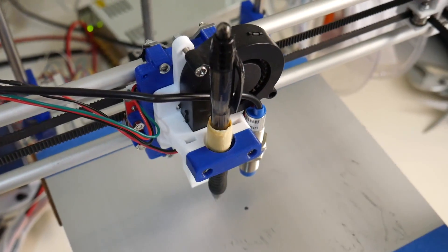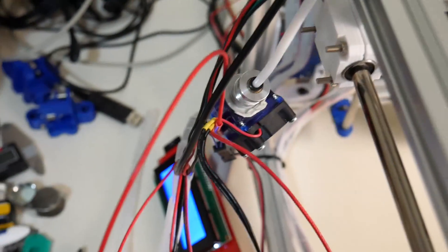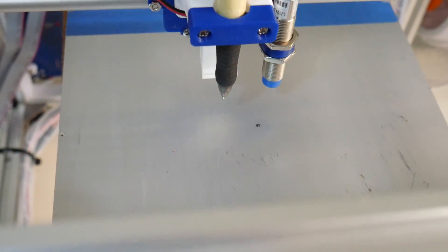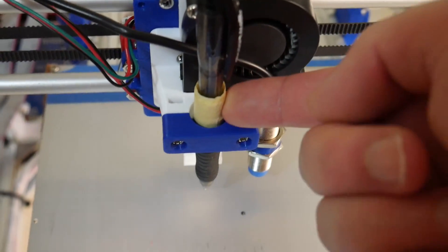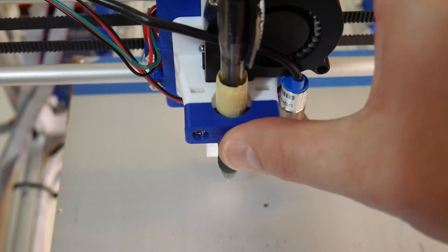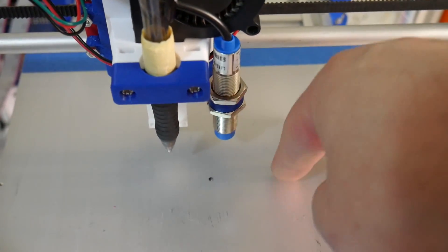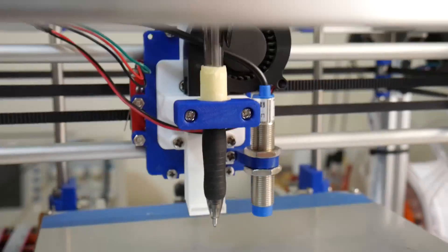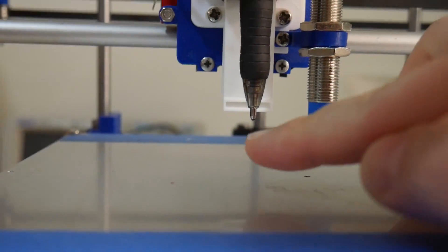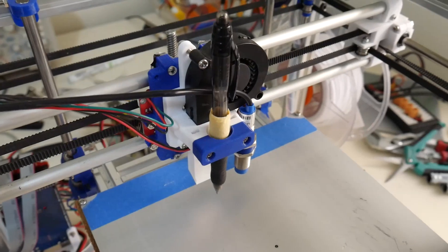Just as a quick proof of concept to see if it could actually work, I've taken off the E3D hotend and I just have the cables hanging off the side of the printer, and I've clamped in a pen. The pen is just a stock standard ballpoint pen, but the diameter is just a bit too small for the E3D clamp, so a dozen layers of tape on the outside allows me to clamp it to the E3D. I'm still using the inductive sensor for z-axis homing, and I have the pen sticking about as low, or maybe a little bit lower, than where the E3D nozzle would have been. So with just that quick change, I've transformed this 3D printer into a 2D plotter.